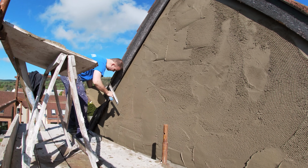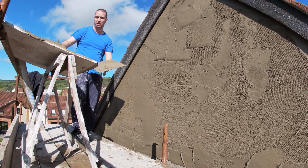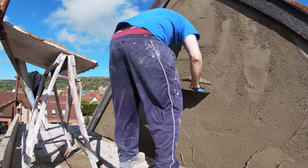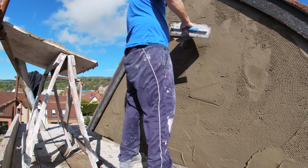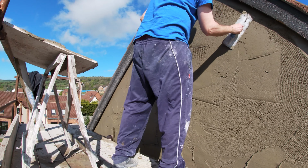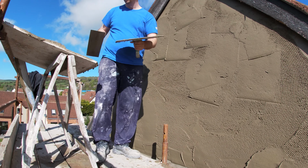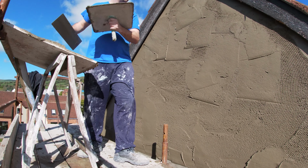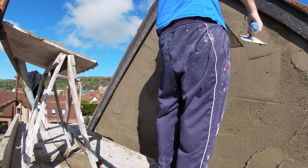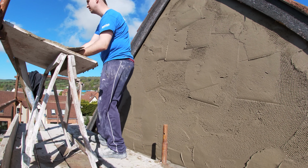When we're talking about coats, another question I get asked loads on is depth. And to answer that, it can be all different, but basically you're probably around 20 mil in both coats. Your first mill could probably be between 5 and 10, and then this top coat's probably again between 8 and 10. Maybe 10, bit more when you put it on, and then when you're cutting it back off, you might lose some in some areas.